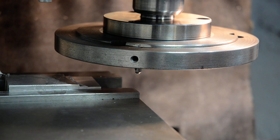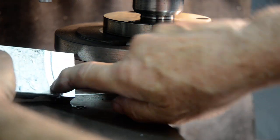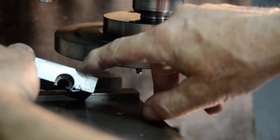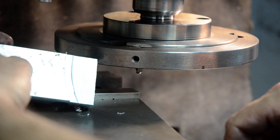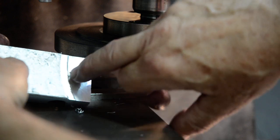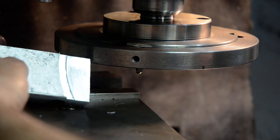That should be enough to see what is going on. Just take the work piece out from the camera. You can see here just a little bit of a burr there. The first one was taking a fairly deep cut, followed by the second one doing the finishing cut half a millimetre deeper. And you can see the effect of the other tool set at a smaller radius, following along six millimetres or so behind the first.